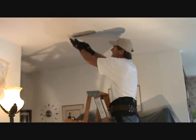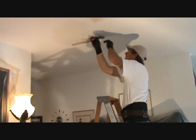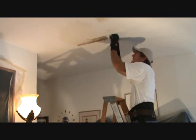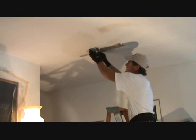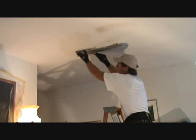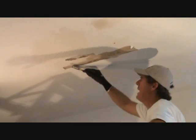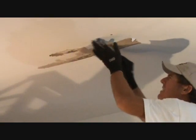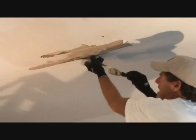I'm going to take some of this off to see how far the damage goes. I've got plenty of sheetrock — a four by eight sheet — and I want to take out the damaged stuff. Make sure you get enough sheetrock; don't get a little two by two patch and then find out your patch area is two and a half by three feet wide.